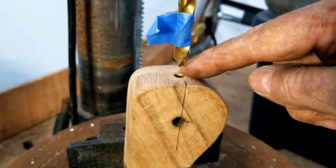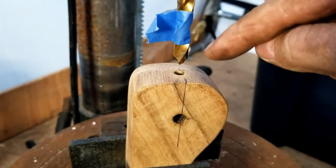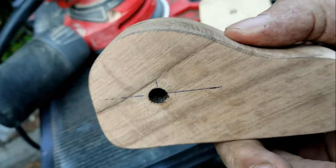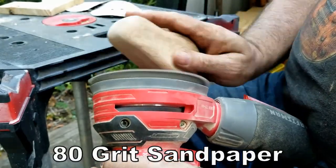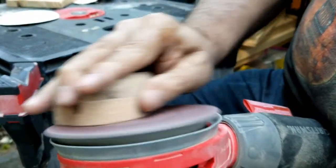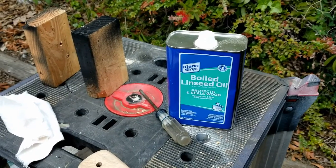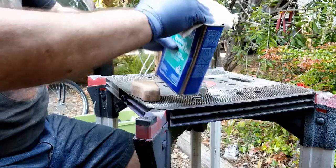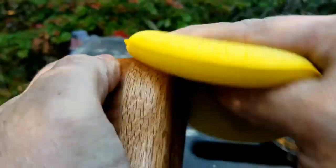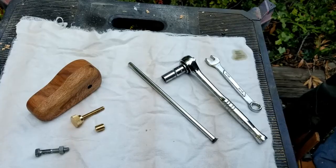This first hole was a quarter-inch hole. The threaded plug that goes in there is 3/8-inch outside diameter, so I need to go down about a half inch into this hole with a 3/8-inch bit. I need to do the final sanding now — got pretty dirty messing around with the holes. Last step before assembly is finishing. I'm going to use boiled linseed oil and then paste wax over the top of that.